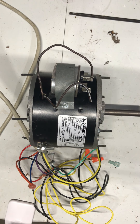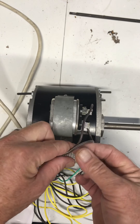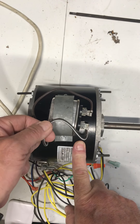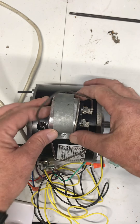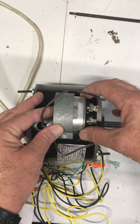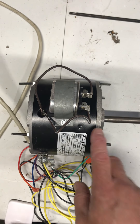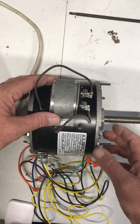One of the key ways to identify one of these motors is the run capacitor. If I see a motor with two brown wires coming out of it — or a brown wire with a white stripe and another brown wire — that indicates a run capacitor. Remember, run capacitors have very low microfarads and are usually oval in shape. That tells me it is a PSC motor.